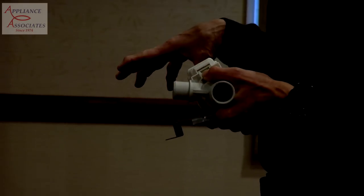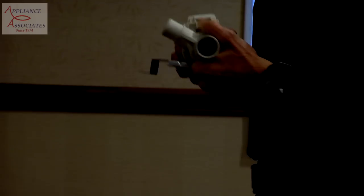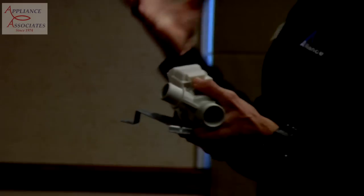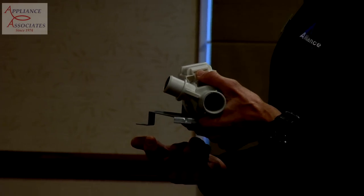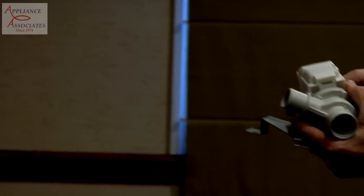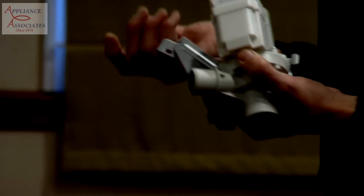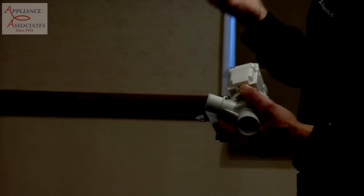One of the reasons is that we heard a lot of sediment tears up the seal. And by the beach, the sand is what's really doing it. So what they decided was, if we stop turning and the sediment settles, we can start to drain first and get some of that out. While it's draining, it will continue to move and sense the load. Okay? What it's doing is preparing for spin. In the commercial world, they call it distribution. So anyway,